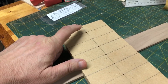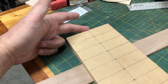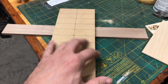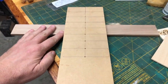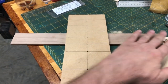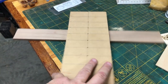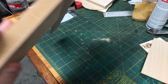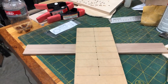You can drill the holes at any interval along this board. The scroll saw blade is going to be lined up right here with the edge of the board. The construction is simple — it's a three-quarter inch thick piece of MDF. This cross board is what I call the clamping board. It sets across the table and we use clamps on each end to keep them out of the way and hold the jig down. The clamp is recessed into the board — I used a table saw to cut a groove and glued the clamping board across there, so we've got a cross shape.